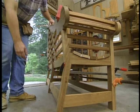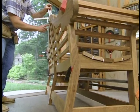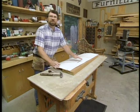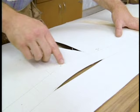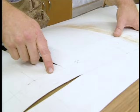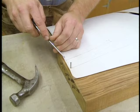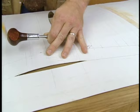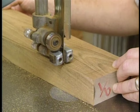Look for a moment at the prototype. There are three legs along the back and they're shaped a little bit like a boomerang. They're all identical except that the center one is a little bit taller. There is enough information in the plan to do a full-size layout of the piece on some poster board. Here you see the back leg — this is the point where the angle changes, and here's the curve along the back of the leg. I've also laid out the curve of the seat support piece and located various intersections of stretchers and rungs so that I can lay out the mortises later. I've tacked the board to a blank to cut the legs, and I'm going to use an awl to mark the critical intersections by making a little point. Where there's a curve we'll mark that with a pencil. After I finish marking all the critical intersections I'll connect the points with a straight edge. Now once again I'm leaving the line — we'll fine-tune it later.